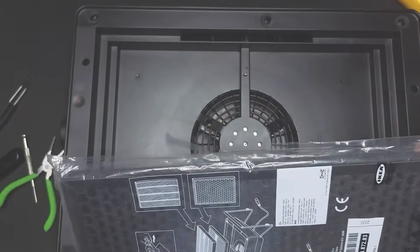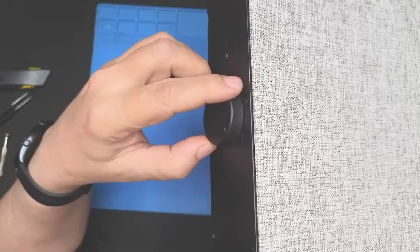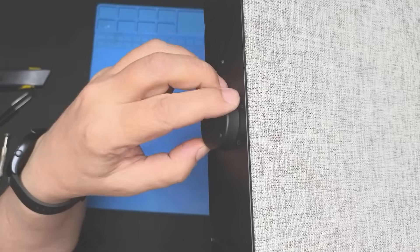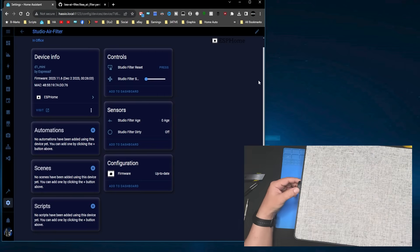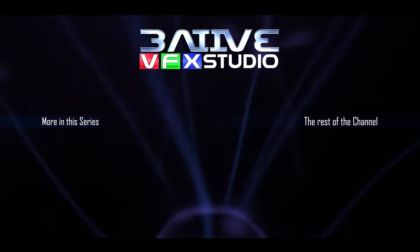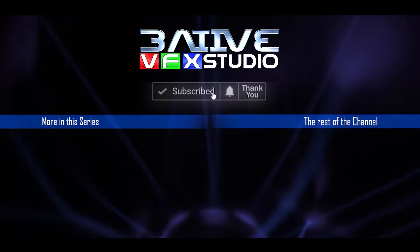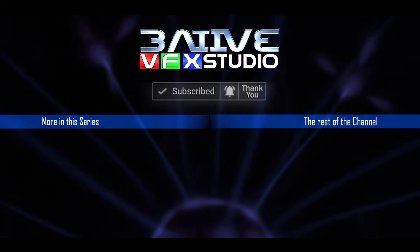I'm ready to deploy this. Let's put some filters in - I bought the extra carbon filter as well, that goes in first, then the paper filter on top, then the lid with the tab at the bottom. One other thing to note: because we're in control of that MOSFET and the PWM signal, this knob doesn't do anything anymore. If you move it, nothing happens - it only runs when you turn it on from Home Assistant. I hope this video was helpful with your projects. Please share it so others can find it. Subscribe and hit the bell icon to get notified - thanks for watching!